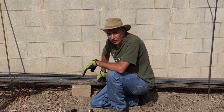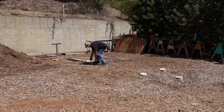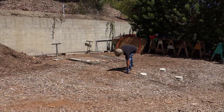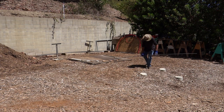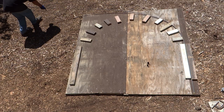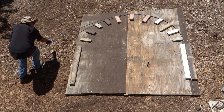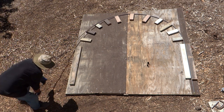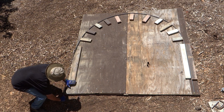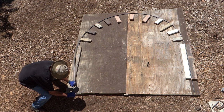With that, I'll show you how I bend it. To start the bend, I laid the rebar between the two blocks with the tip level with the end of the plywood. Then I grabbed the middle of the rebar and started to bend it around the arch blocks. When you cold bend rebar, it has a lot of spring to it and it wants to retain its shape. If I had an oxy-acetylene torch or some other heat source, it would hold its shape.